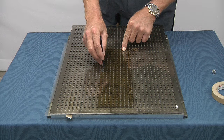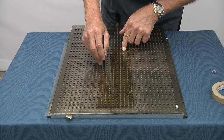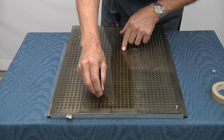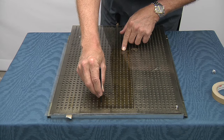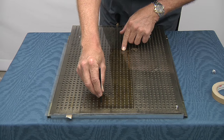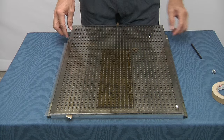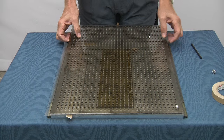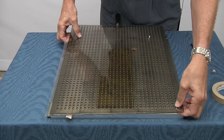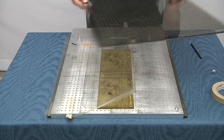We transfer this several times on the die, picking up mounting points along the area of the die in the non-image areas, hitting it with a hammer so you get a nice indentation for your center drill. Once you've positioned the die, mounted the jig, and used the center punch to punch the indentations where you're going to drill, you remove the jig.